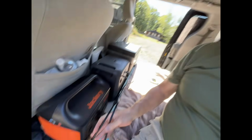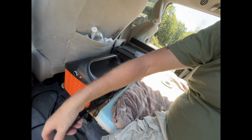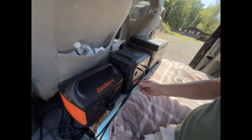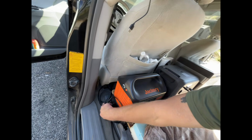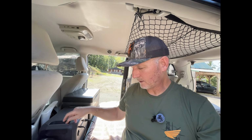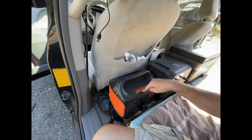After this summer, I bought this splitter so I can connect both solar panels into a single input, and that made a significant change. So that tells me that if I had one 200-watt panel, it would really be more efficient. And then if I had the third panel, I could connect it into this one.